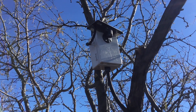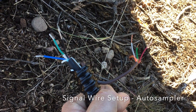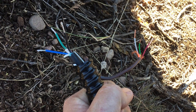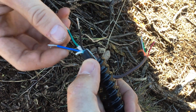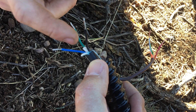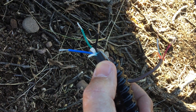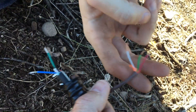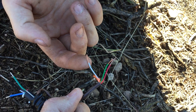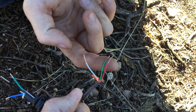Using cellular is a little bit cheaper than going the satellite route if you have coverage. Coming off of the auto-sampler we have the blue wire which is its ground, the green wire which is the signal for when the program is all complete, and the black wire for when we want to trigger the auto-sampler. So these three are fed into our REM. Then these three wires are coming from our switch: the power wire red, the ground wire white, and the signal wire green. These feed into our REM as well.